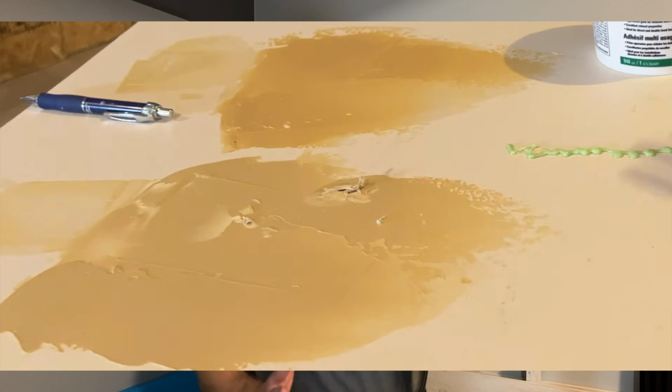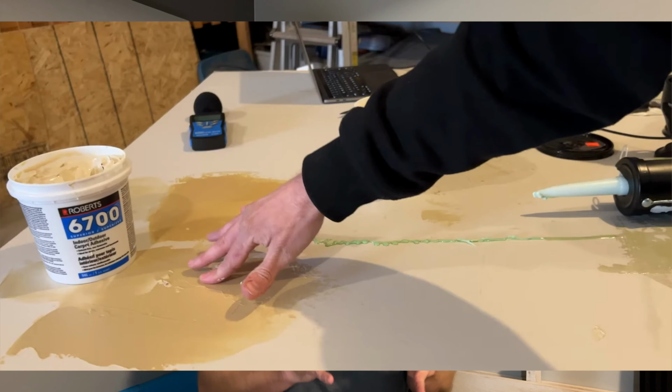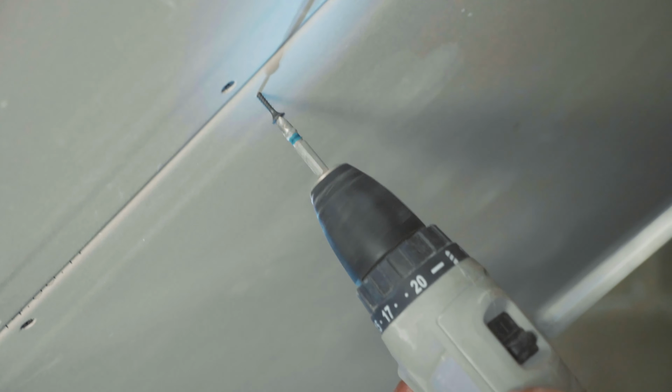And what you'll want in between the drywall is an acoustical compound, but I found something a lot cheaper that works almost just as well, which is a certain type of carpet glue. Just make sure to completely cover the sheet with the carpet glue. And just because it's glue doesn't mean you can skip the drywall screws. Even though it's carpet glue, you still use drywall screws. But by spending just a little bit more money and adding that carpet glue in between the 2 or 3 layers of drywall, it will help drown out a little bit of noise that could potentially keep coming through.